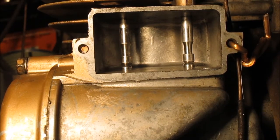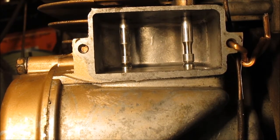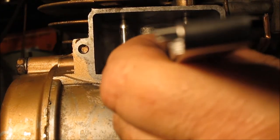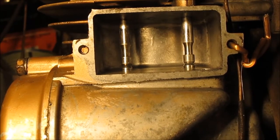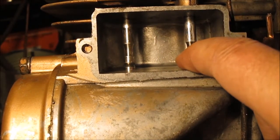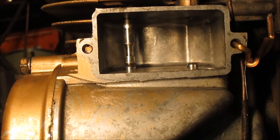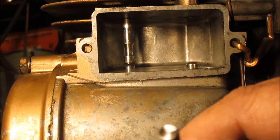We went to a 7 because 6 didn't feel right with the feeler gauge. When I put the 3 and the 4 together to make 7, it seems more accurate than the 6 — the 6 is like 6 and a half thousandths if I check it with my dial calipers. So there's 7, and I'm putting a lot of pressure on top of the valve now. 7 is the maximum — intake is 5 to 7, 6 is in the middle. We're out to do the exhaust, and it does take quite a few turns to get it on that wheel. One turn is not a thousandth — it is so fine that you have to really spin it quickly.